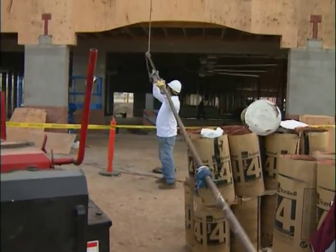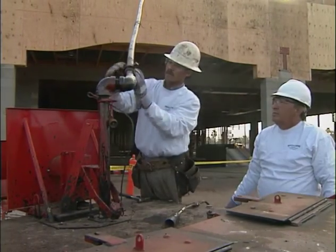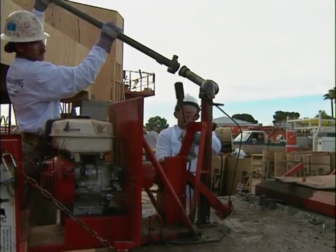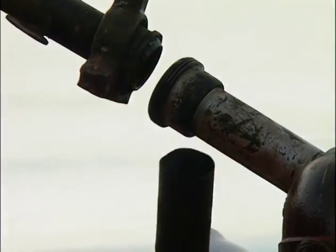Hoist one end of the assembled pipe to the roof and connect the other end to the coupler of the outlet pipe on your tanker or kettle. When heating this coupler, it is extremely important never to point an open flame into the outlet pipe or any opening where fumes can seep out of the tank. This could ignite fumes inside the tank, causing a powerful explosion.